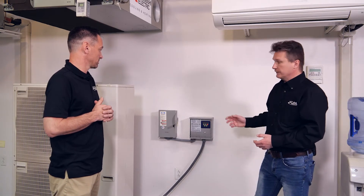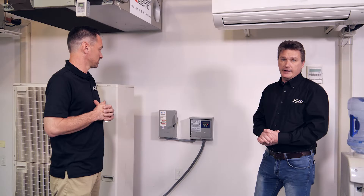Today this is going to be installed on a three ton Mitsubishi system. We do have another model coming out — the ICM 493 with a 60 amp contactor built in — and that will be sufficient for some of the larger five ton units.